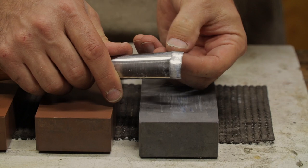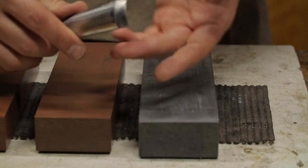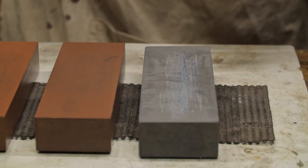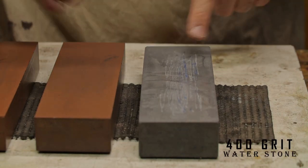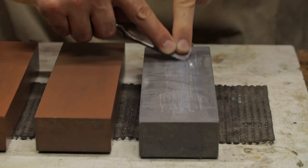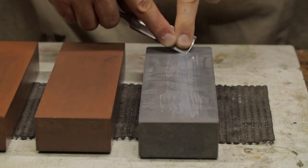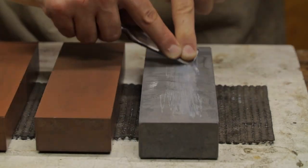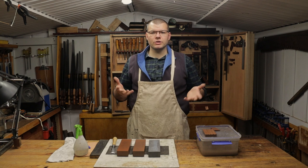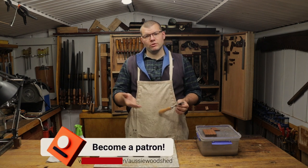You can see there's a little bit of the marker pen left back here — it's very light. But the sharpening has come right to the edge and you can almost feel a burr; there's a very fine burr on the inside. Let's go ahead and give this a good sharpen. We'll use this first stone, and now I can definitely feel a burr on the inside. Those of you who have seen any hand sharpening or chisel sharpening videos will know that we have to remove that burr before we move on to the next grit.